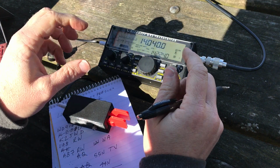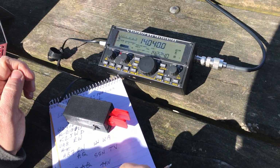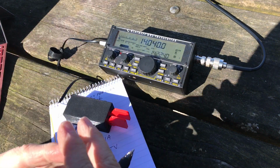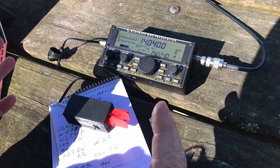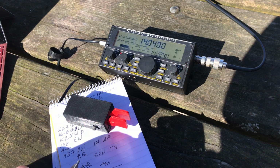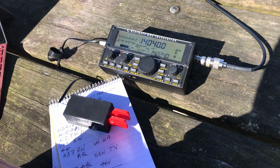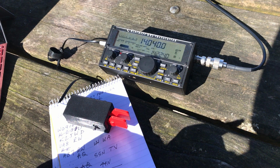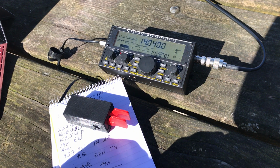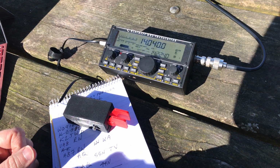Excuse me. And the great thing, the most amazing thing about having this antenna, so I have people ask me all the time, well, why don't you use a more efficient antenna than a vertical? So a vertical, in this situation here in Western North Carolina, is not an ideal antenna, actually. I mean, they really aren't. We have poor ground conductivity here, and it's just not the most ideal antenna, but they work. And I mean, it would work really efficiently if we were on the coast, like near saltwater or something.